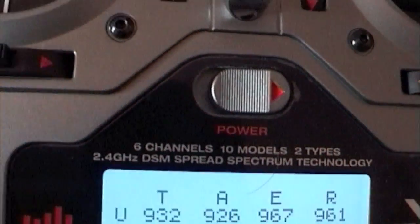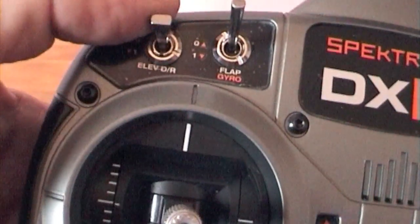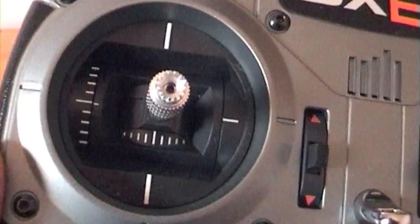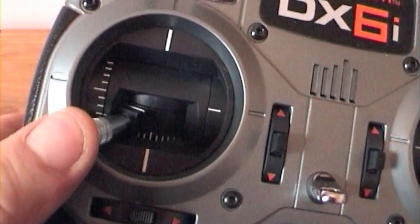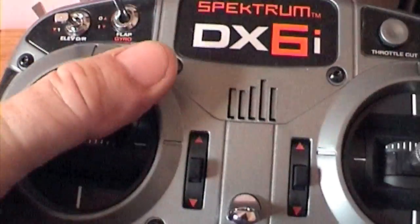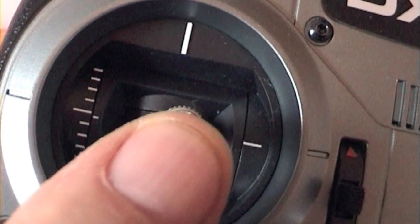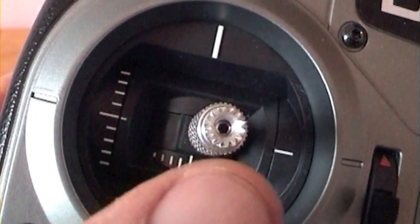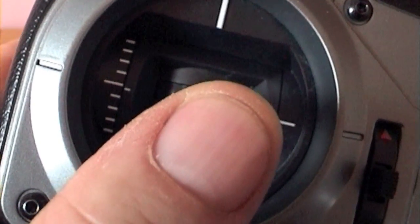The way to set this: your elevator switch — this one here — switch to on, number one. This will set up the lowest position on the control sticks. Then you just go through a simple matter of all your positions in the shape of a square, and make sure you bring that one back to zero, because that's where you want to set it. If you want it slightly lower, this is the time to do it — set it there before we kick in the memory.